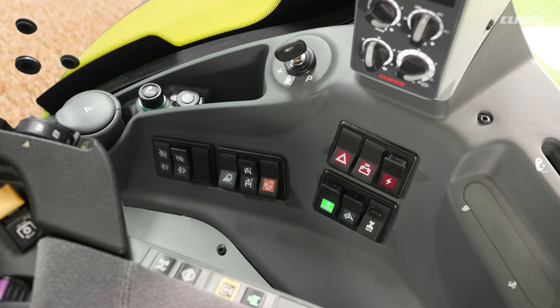Also, and one of the most noticeable points from an operator's point of view, is when we are changing direction. If we think about maybe a silage contracting outfit coming into the yard to change direction and dump our load, when we move from forward into the reverse direction on the move, it will automatically apply the trailer air brakes to help slow down and have a smooth transition into reverse.